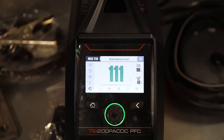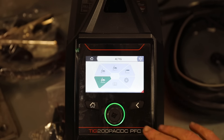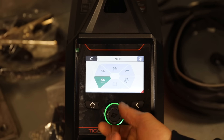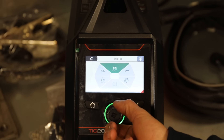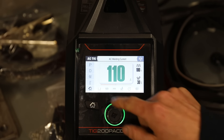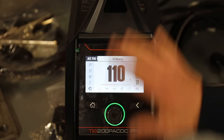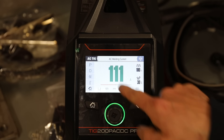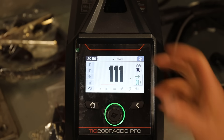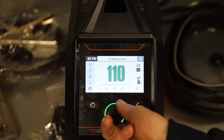It's got a nice clear display — probably won't look that clear through the camera, but I don't want to peel this film off yet. This has a really simple and easy user interface. Just select whatever type of welding you want to do, and then you've got this adjuster to turn each setting up and down. You can press the centre of it and cycle your way around. I like the fact that on AC welding, the hertz and AC balance are basically on the front page — sometimes you have to go into different menus to get to those settings.